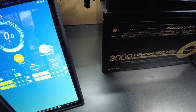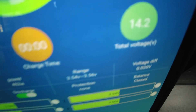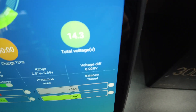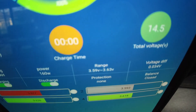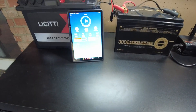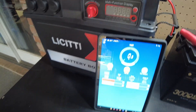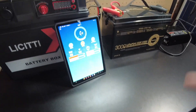We're going to start charging one more time to see what voltage it charges up to. We're at 14.1V, then 14.2V — everything's still nice and balanced — 14.4V, 14.5V. So we got 14.5V. That's really good. Honestly, perfect would be 14.6V, but 14.5V is plenty good. Now I'm going to set it up and do a discharge test.